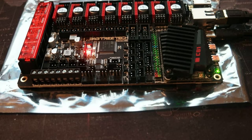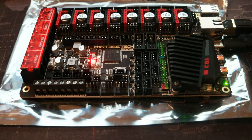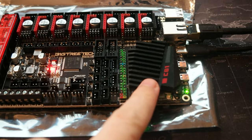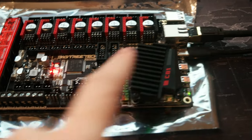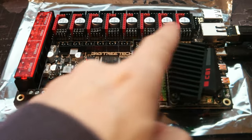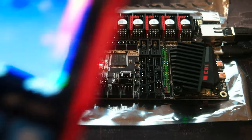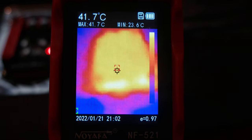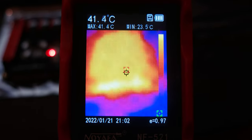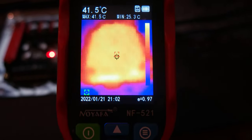I don't have any load, so this is like a base measurement. I just have the CB1 installed with the heat sink, and the power is through USB with the jumper and Ethernet attached. No drivers, no temperature sensor, no other sensors. Looking at the heat sink of the CB1, it's around 41 to 42 Celsius, give or take.